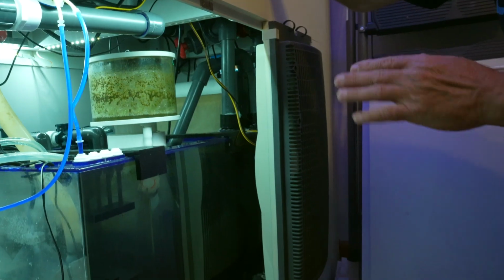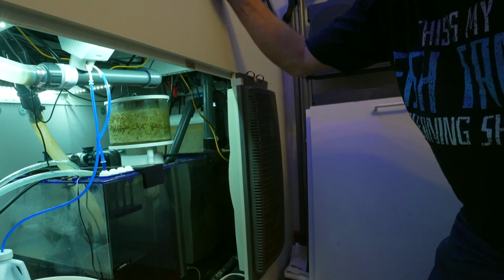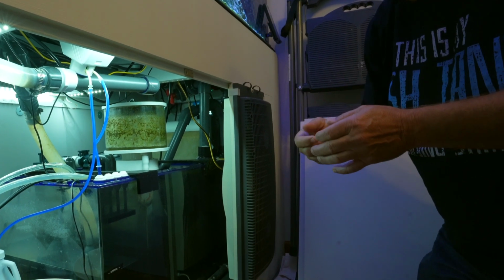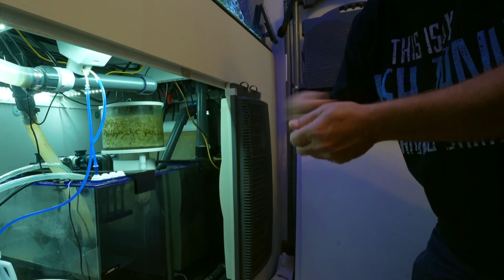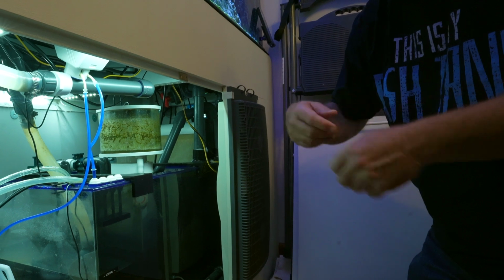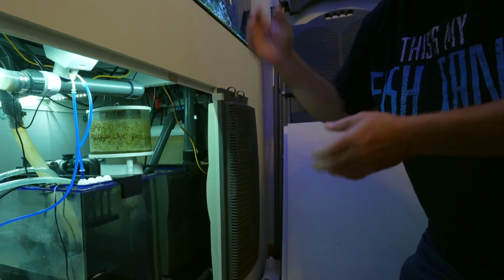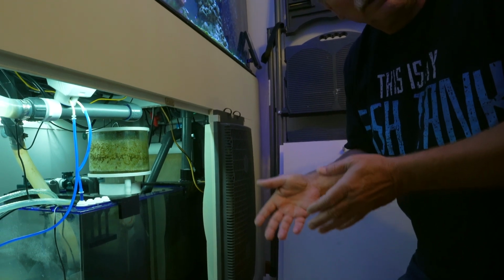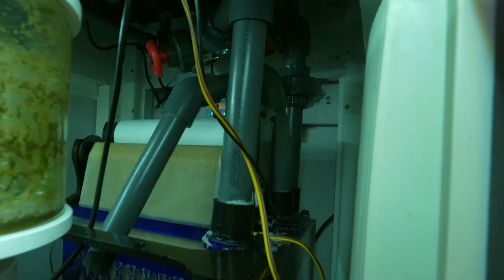My issue with their sump, with their roller system, is the guide rollers in that fleece chamber are not removable. You cannot take them out and clean them. You have to try to scrub them in place. So you wind up having to try to rotate them by hand and scrub the debris, the barnacles, the spheroids and stuff that builds up on it. You have to try to scrub them by hand in an area where you can barely get your hand into the chamber. So it is not serviceable from a practical standpoint. And that's a major design issue in my opinion.